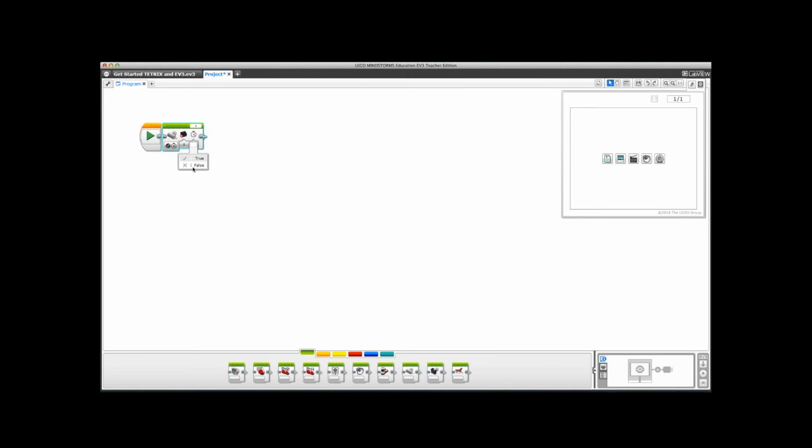So if you think of that, and again, you can type in that value if you wanted to, if you have trouble using the slider bar. But that's going to be the default mid position. That's where most servos will initialize to that mid position or try to go to that. So that would be the move, and then the last one would be update interval.